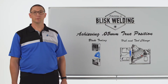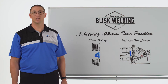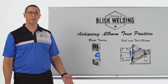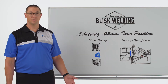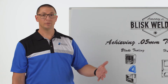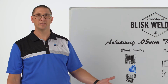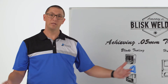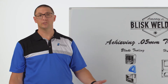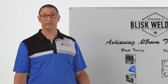Thanks for joining me for MTI's Whiteboard Wednesdays. I'm Dan Adams. Today we're talking about the accuracy associated with blisk welding. In previous episodes we talked about the linear friction welding of blisks. Blisks are bladed discs where we're welding an individual blade to a disc up to 20 times in order to make a full assembly. These are typically made out of titanium. They can be maybe four feet in diameter on the large side and they're used as either the front fan or part of the compressor section of an aircraft engine.